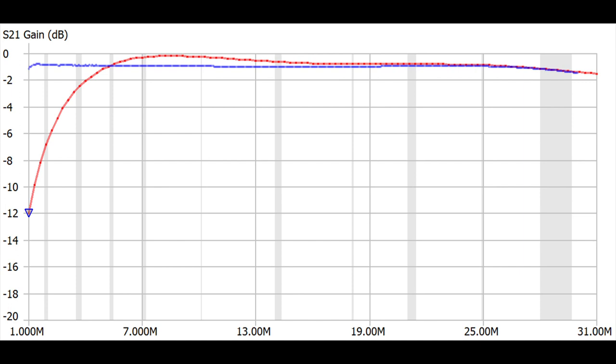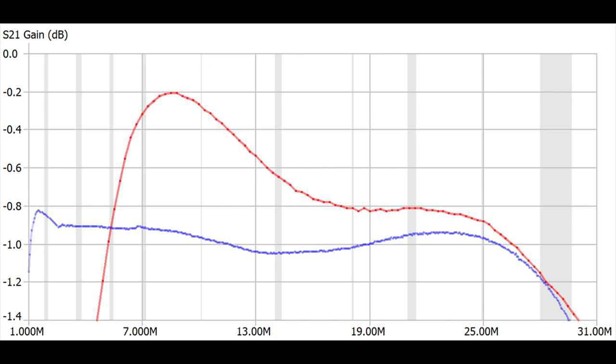So this thing is so good, I think I'm going to zoom in closer. All right, now that's zoomed way in. And look at that. What a difference. I should have mentioned this is a two-turn, 14-turn wind. And it did like a 120 picofarad capacitor best. I did try it three-turn, 21-turn. If you do that, you're going to kill the top end. But yeah, look at it in comparison to the best 80-10 transformer I've made in the past. Down on 40 and 30 meters, it's only got like one-third of the loss. Only about 0.15 dB per transformer. And then tapers up until it's about the same at 10 meters. But this thing should be really good for a 40-meter to 10-meter wire.